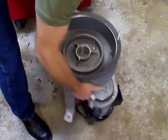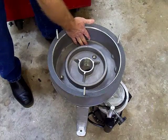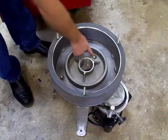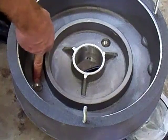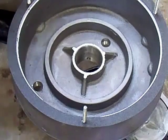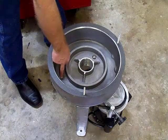Inside the centrifuge is a dam and it separates the clean oil on the outside from the sludge that runs on the inside. The sludge drain here is three-quarter inch pipe thread; outside is three-quarter inch pipe. We can take it all the way up to two-inch. If you have a thin product you want to drain through there quickly, you can use the two-inch. But generally for oils, you run it slow enough — three-quarters is good.